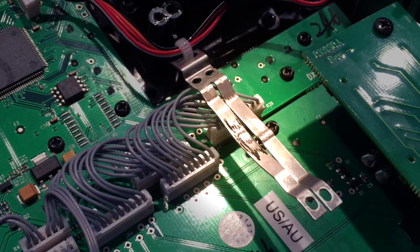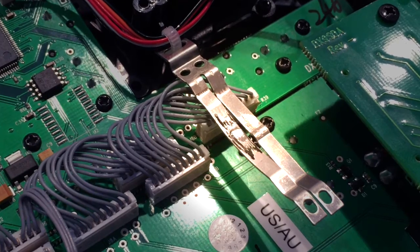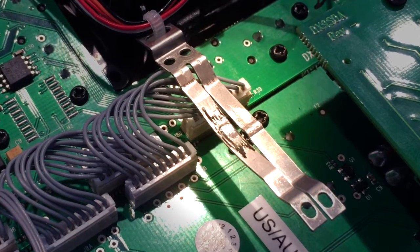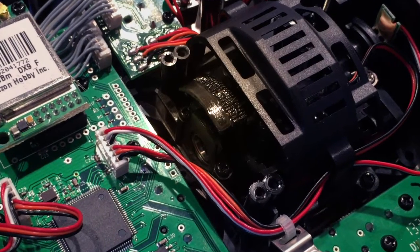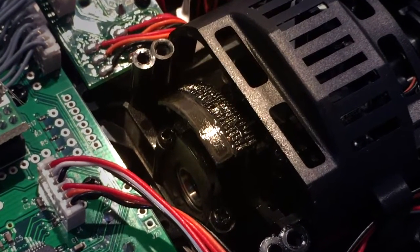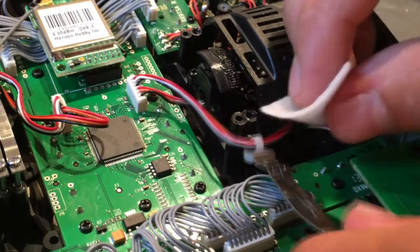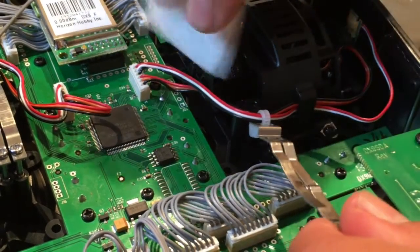Now look how dirty the friction bracket has become. It's got spent grease, dirt, grime, and microscopic particles from the plastic that it rides up against. Here's a close-up shot of the plastic on the gimbal. Notice all the dirt and grime that's on there. This is from typical wear and also the dirty fields that we fly at. So take your alcohol pad and wipe all that grime away.